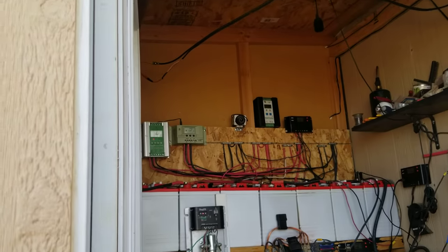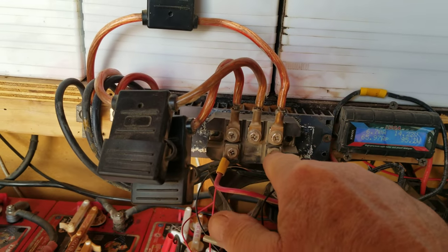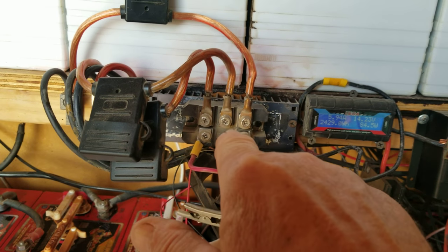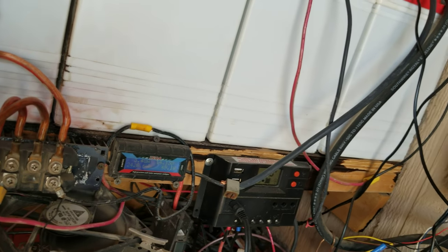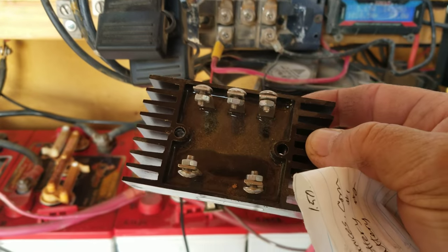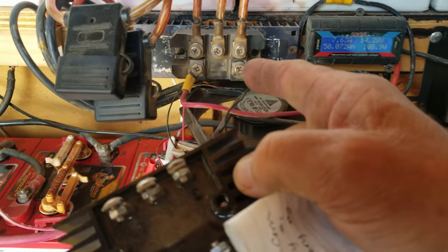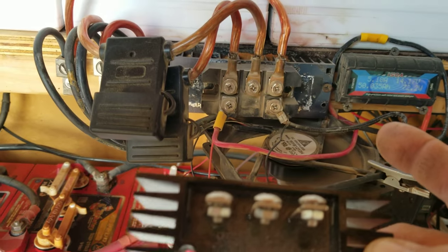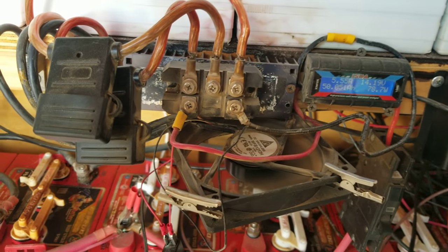That's why I went with the three-wire — because that allowed me to put my rectifier right here, down here, where it's easily accessed. If something goes wrong, I've got a spare. I can pop that one off and pop the spare on. You definitely want to make sure you always have a spare rectifier. That rectifier didn't come with a heat sink, but when I go through the desert I find people dumping old TVs and things like that, and I take all the electronics out and save all the heat sinks — they come in handy down the line.